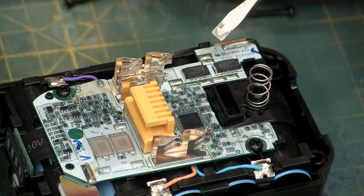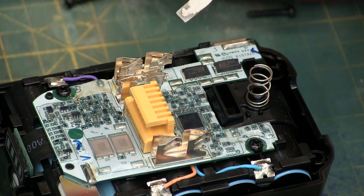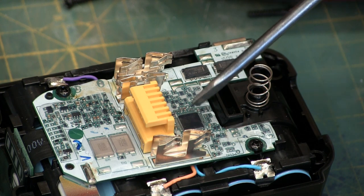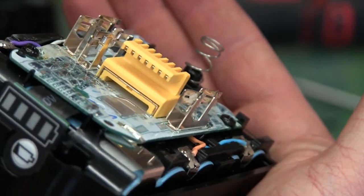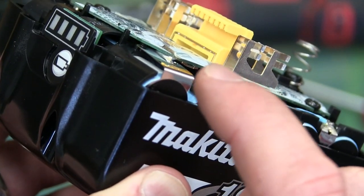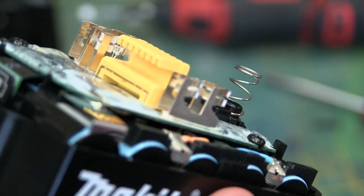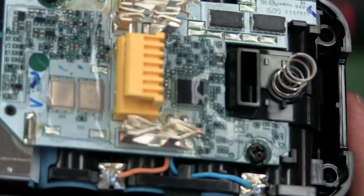There are some interesting packages here — these are MOSFET devices packaged in thin aluminum-looking casings, very interesting. And over here these components are stood off on what looks like Teflon standoffs, and for all the world they look like miniature insulated gate bipolar transistors — like you'd see in a VFD, a variable frequency drive, or some high-voltage device. Of course there's the microcontroller — I can't make out what it is. The connectors themselves have something interesting going on — looks almost like silver plating — and there's some burn-in at the back, a different surface finish. That might be nickel plating; I'm not sure — if someone can identify it, I'd appreciate it.